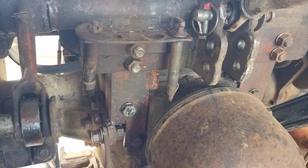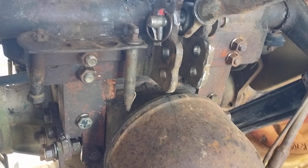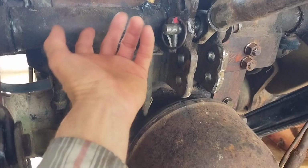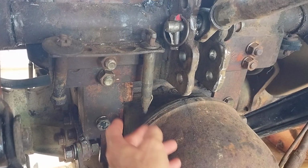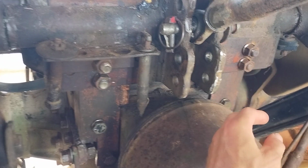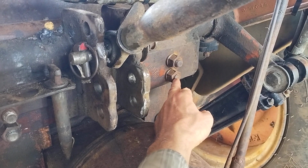And sure enough, it was tore up so bad. A bolt was bent pretty bad, so I found a little bit longer one. On that one, I put a washer behind it. The other ones looked like they weren't long enough. Well, two others were long enough to have a flat washer. But see how there's only one thread sticking out?